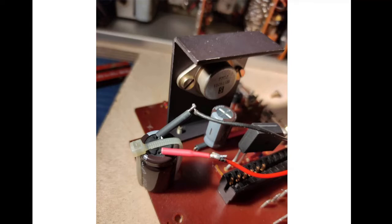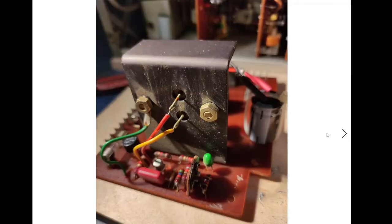This is the new capacitor that replaced the old big one for the 27 volts. The new one is much smaller — this is okay. I could put more capacitance there but I didn't. This is the other capacitor. The new bridge rectifier. These are the wires soldered to the main transistor.